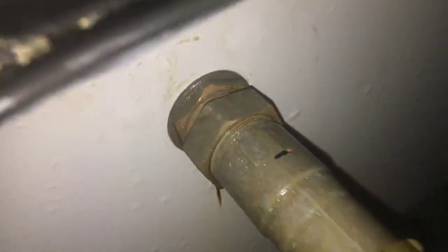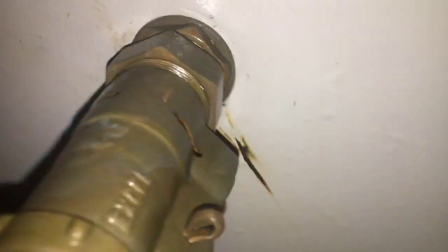This is an insulated tank, so I took the lid off the tank, and you can see on the valve there is actually a hole in the top of the valve there, and one on the side as well. What's happening is the water is spraying up and going between the two sections of the tank.